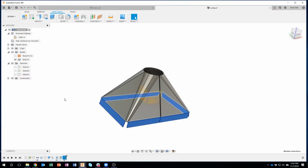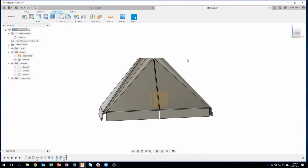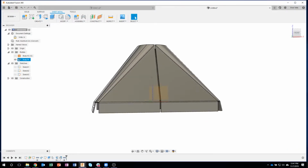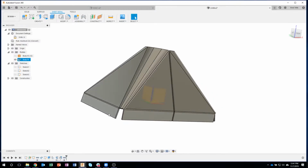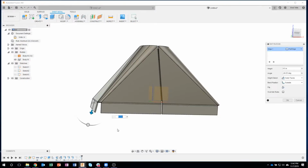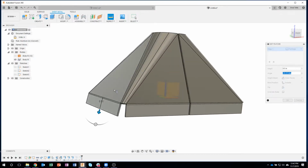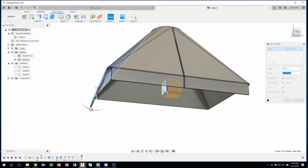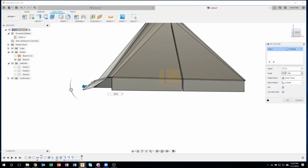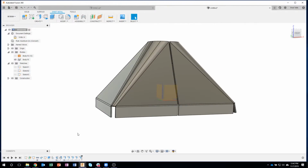Okay. So I just glanced over really quick. I saw Ron said, hey, you could probably like 3D print this, use it as a fan shroud or something like that for your 3D printer. Now notice the angles changed because I changed the size, so I would have to go back and remeasure, but that's what's really cool about, let me find that flange, it's this guy right here. So all I have to do is say measure the angled face with the flat face and give me the difference of that, and now it's straight up and down again. So that's what I love about parametric design.